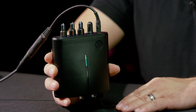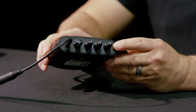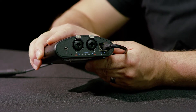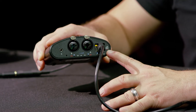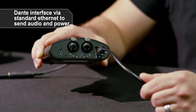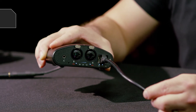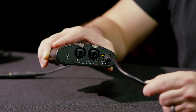This is really two devices in one. It's a headphone monitoring mixer with headphone amplifier, and it's an interface for microphones, instruments, and line inputs. This is a Dante device, which means it works over standard Ethernet. You can send audio and power over a single Ethernet cable with other Dante devices on the network — other Switchback Matrices, a laptop, a soundboard, anything with Dante capabilities.